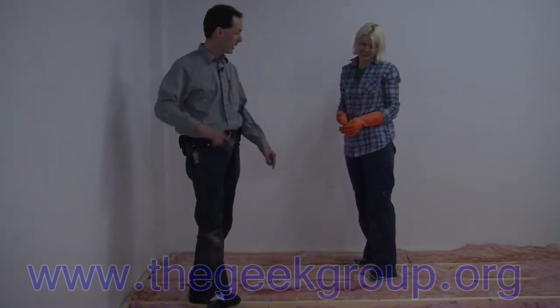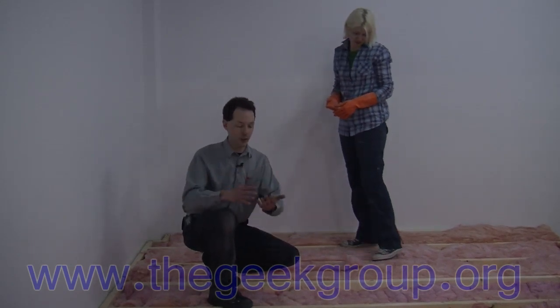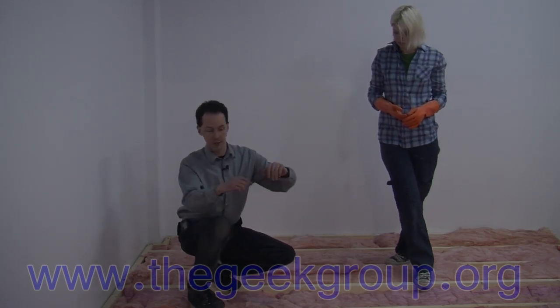Oh, just a little thing. If you get the itchies from fiberglass, a thing that will help a lot is cold water. If you get it on your hands and arms and you're all itchy and you hop into a really hot shower, all your pores open up and it sucks the fiberglass right down into your pores, and it's going to suck for a week. So use really, really cold water. Lava soap works really good. If you've got it really bad, like on your hands, take a goop of rubber cement in your palm and rub it around until you end up with a ball of it, and rub that all over your hands and it'll pull them out. It works really well. I've used that 1,000 times.